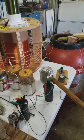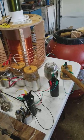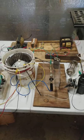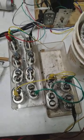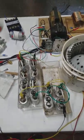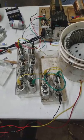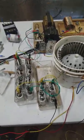Imagine what these things can do driven at a much higher frequency, which is what I'm feverishly progressing towards with a high voltage driver. Ironically this is a Tate circuit turned sideways with the diodes reversed. It definitely seems to be a little more amperage output from the Tate circuit than from the standard multiplier, though what's different about the two I'm not real sure of yet.